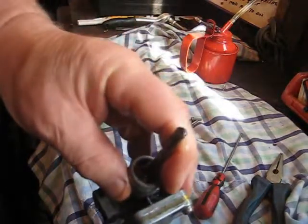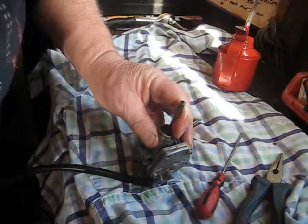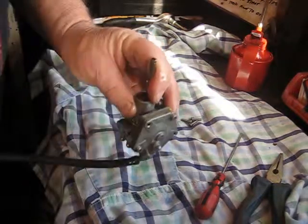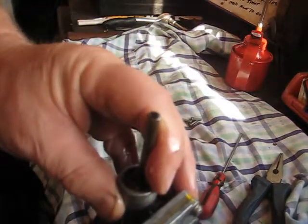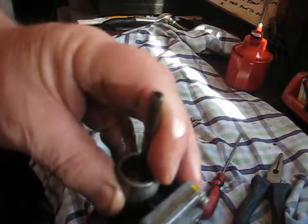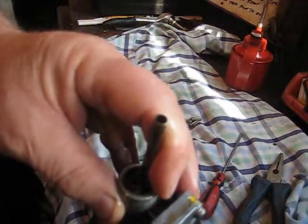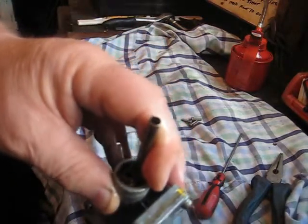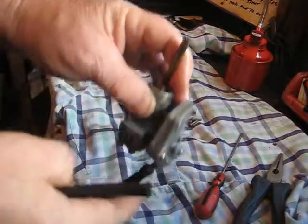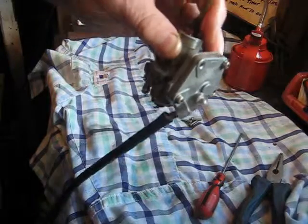You can see a little bubble of fuel on top. If I suck on this pipe, it disappears straight away — so when the vacuum is working, it's opening that valve to let the fuel go into the fuel bowl at the bottom. If I suck on this now you can see it disappear straight away, so this diaphragm is now working. It's switched off because if I blow on that now I can't blow through it. If I suck on this pipe which is connected to here, it opens — the diaphragm pulls back, opens that valve and lets the fuel through.